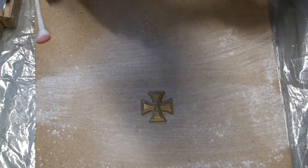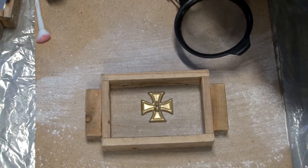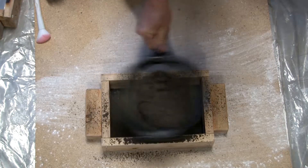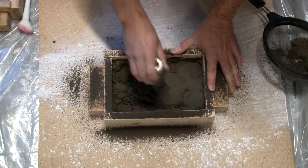The powder that I'm using here is just baby powder. I use it to dust the parts so the parts come out of the mold easily. I also use it as the parting powder. At this point I'm using the strainer to separate the sand and just put the finer particles onto the part. Gives it a better, cleaner finish.